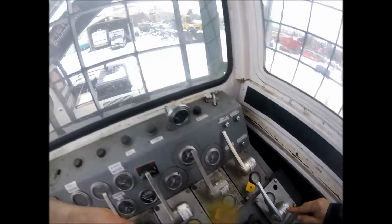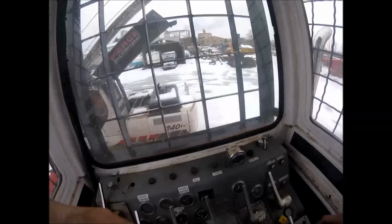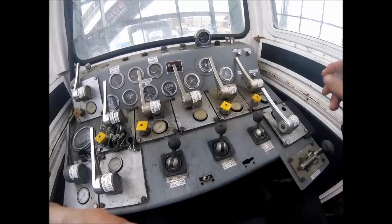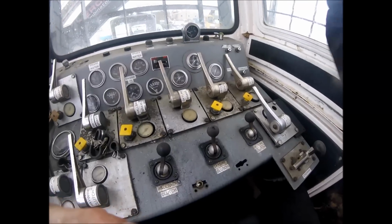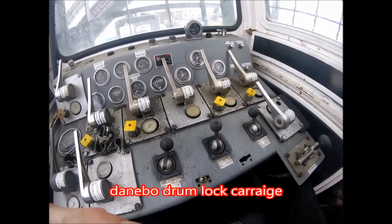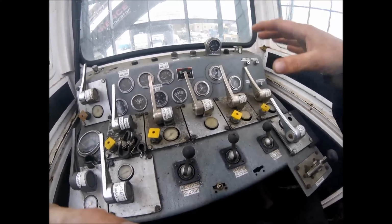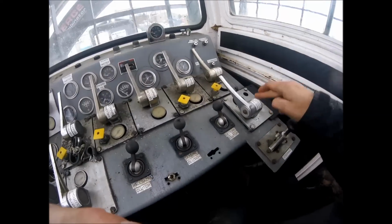We have not talked about a tagline yet. The Madills have the Skyline, the skid line, the haulback, Haywire, and a tagline. It's just a secondary Haywire drum, but it's used for those. There's certain carriages that you have to have the tagline out to use them, and I'll go over that. I'm not going to try to explain it all in this video, but that's what the tagline is for.